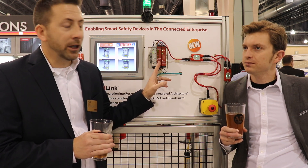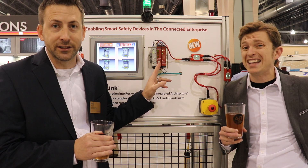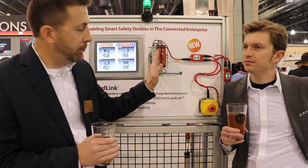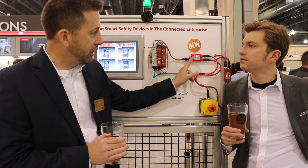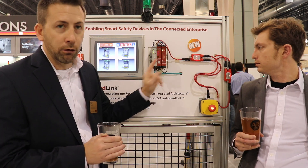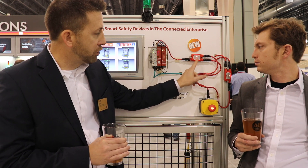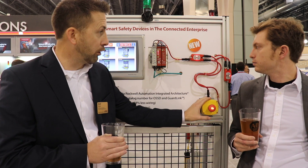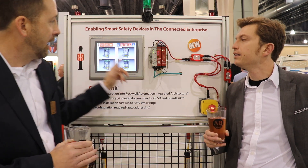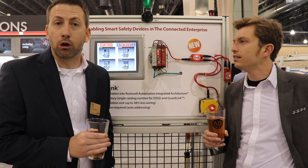Now when it comes to the GuardLink solution, how does it help address this problem? We're able to keep one safety relay but hook up to 64 different safety devices in series. You can mix and match whether you want light curtain, e-stop, door interlocks, or even guard locking switches. We have a communication path that goes down to our smart taps, and each one shows whether or not my e-stop is okay. If I press it, you can see that shuts down the line and stops the relay, but I also have visual indication locally. I can also communicate over Ethernet and get full diagnostics of everything hooked up to the safety relay, knowing exactly what's wrong or if there are any faults.